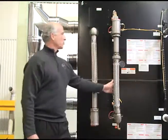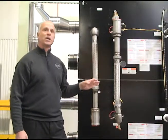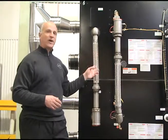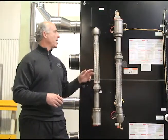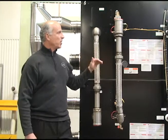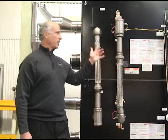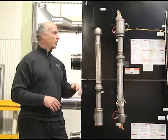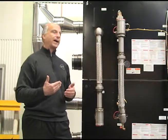These are all pre-piped for you. The whole idea is to have two boilers give you greater redundancy and greater turn down. Each boiler is 5-to-1 turn down, and the total turn down is 10-to-1. Each boiler will operate independently, but with the common manifold that gives you one hookup for your entire system. If one does happen to go down for whatever reason or you're doing maintenance, you have that backup.